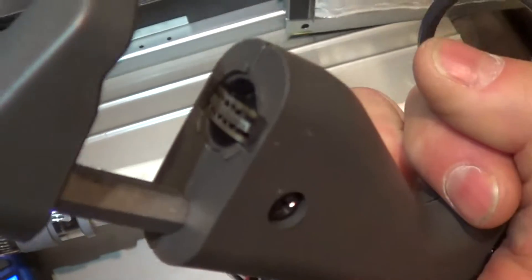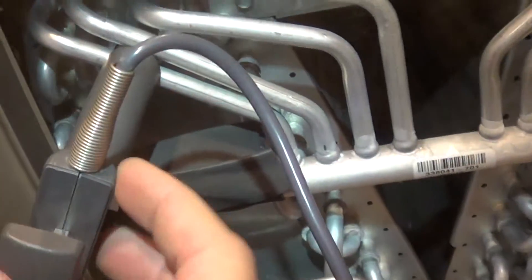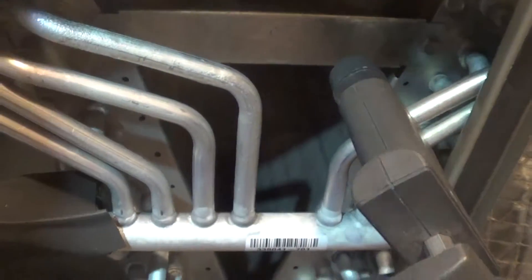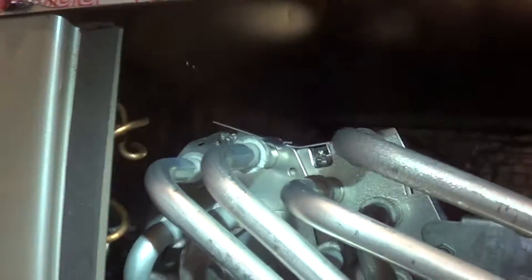This is the thermocouple — a very thin ribbon thermocouple, much more accurate. I can check these three. So we got 51 degrees on the left coil, 40 on the one that's overfeeding, and 53 on the third. The expansion valve is pinching back because of the one overfeed, and that's explaining our lower suction pressure.